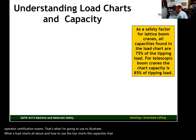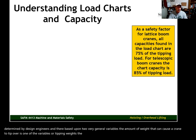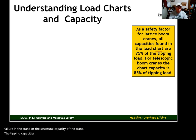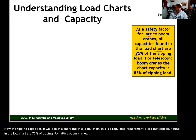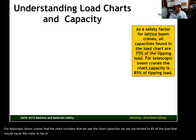The capacities in these load charts have been determined by design engineers and are based upon two very general variables. The first is the amount of weight that can cause a crane to tip over — the tipping weight. The other variable is the amount of weight that can cause a structural failure in the crane — the structural capacity. The capacity found in the load chart is 75% of tipping for lattice boom cranes. For telescopic boom cranes, chart capacities are limited to 85% of the load that would cause the crane to tip. So there is a safety factor built into the charts.